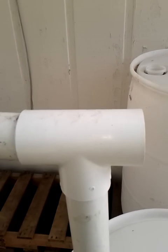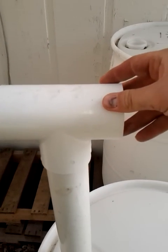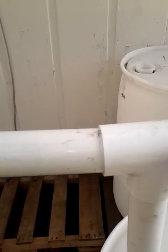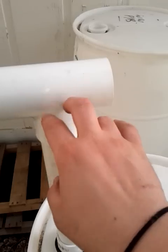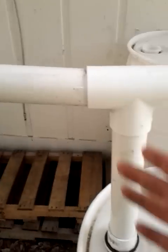The final part is used on the remaining connecting barrels — and you can have 100, 200, 300 barrels, or just one or two. This one is the two inch PVC S by S by ST fitting. It runs $2.44 and this is going to be your most expensive part — the SKU number is 232726. Basically, once again, water comes over, falls down into the barrel, fills it up, comes back over, runs into the next barrel, and you can expand to as many barrels as you want.